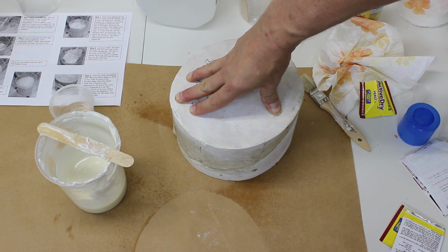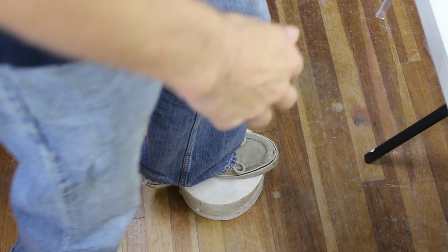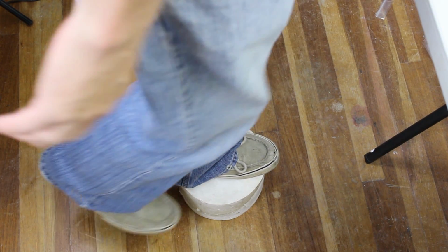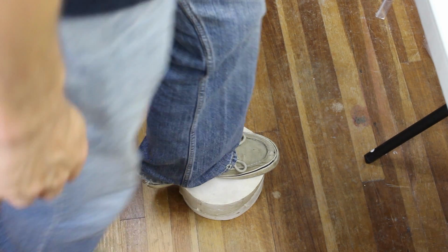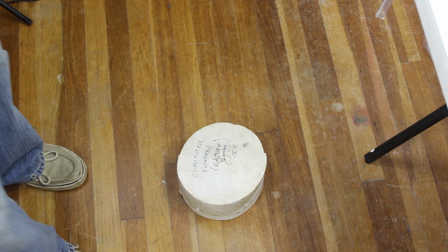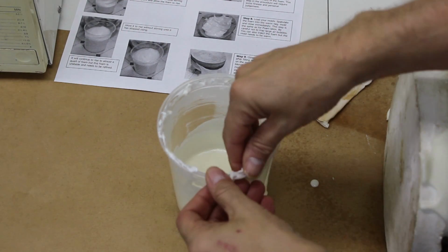A good idea, if you're not too heavy, is to place the mold on the floor and carefully stand on it, but only if your mold is well constructed with reinforcement and Ultracal. Plaster of Paris is not suitable for this. This is a trick taken from foam latex processing, but will yield very thin edges.